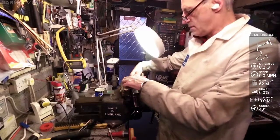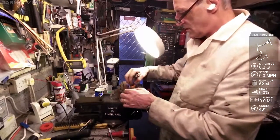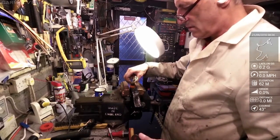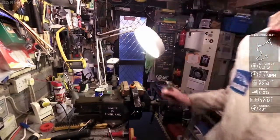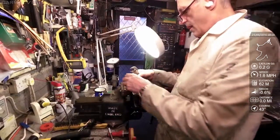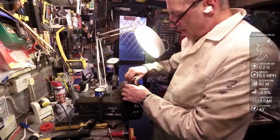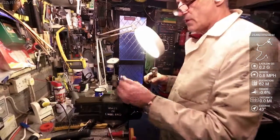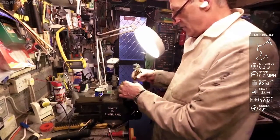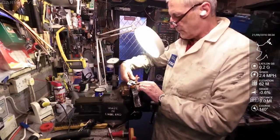So it doesn't damage the thread. No it hasn't. I'm going to need a thinner washer to get it started. Let's see what I've got available. There we go — so that's just a random washer that I happen to have in stock, and that luckily is thin enough to allow the nut to catch a few more threads.